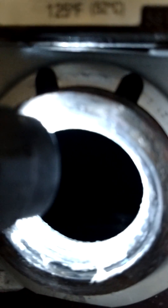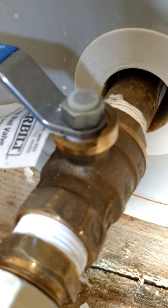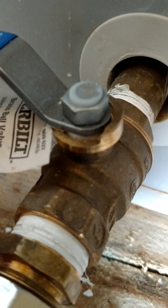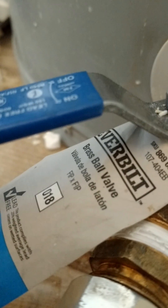That is the process I'm doing to clean out this water heater. I learned this from YouTubers and put a few things together that work for me. Using this ball valve — three-quarter inch brass ball valve — with a little extension that screws inside and onto the ball valve to get the water out.